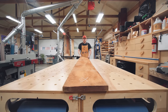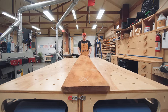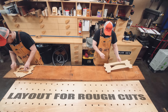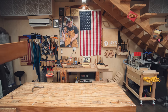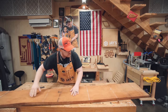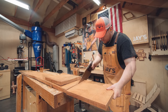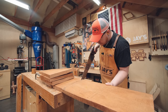This project starts out with a really twisted board, and in this case it won't matter much because the multiple smaller pieces I need will have a manageable amount of twist. But I thought it would be interesting to show just how bad a board you can work with if you utilize it the right way. This board is about 12 inches wide, a little more than an inch thick, and the twist shown is through 8 feet of the board. I laid out pieces based on the amount of twist rather than trying to maximize use of the board. The board was too twisted to safely cut with the miter saw so I took it to the workbench to cut by hand. I remember I was a little cold and sluggish that morning, and I recalled my grandpa saying 'cut your own firewood and you'll warm up twice.' Cutting this mahogany by hand definitely warmed me up just a little bit.